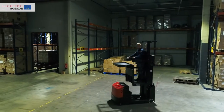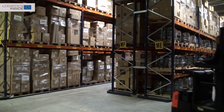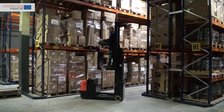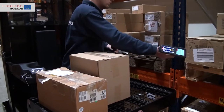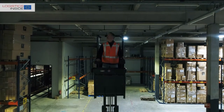In our test the truck not only proves them right, it also sets a new set of benchmarks. The EP JX-1 describes itself as a medium level order picker, an intermediate between the work assist vehicle and an industrial order picker. The truck has a load capacity of 500 kg and can reach work heights up to 6.5 meters.